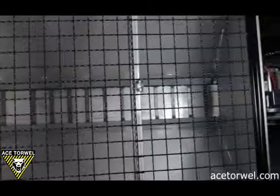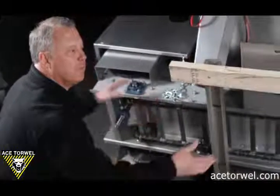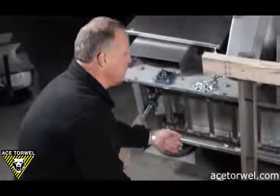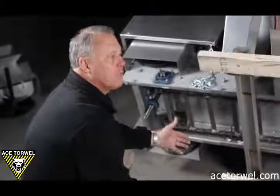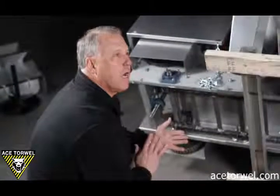An optional inverted V is mounted on the inside of the hopper to help prevent the bridging of the sand, and it actually takes the sand and pushes it to the outside wall of the spreader. The undercarriage, or the conveyor system, other than being shorter or longer, is all the same. So whether you have a 1.3 yard capacity spreader or a 5 yard, 9 foot capacity spreader, the carriage or the conveyor systems are identical.